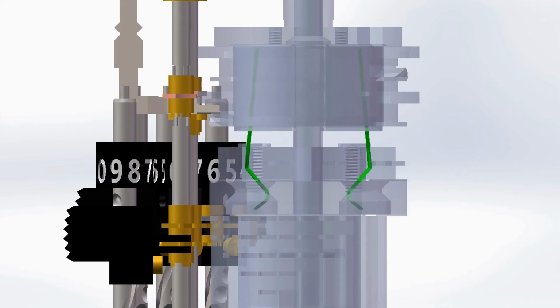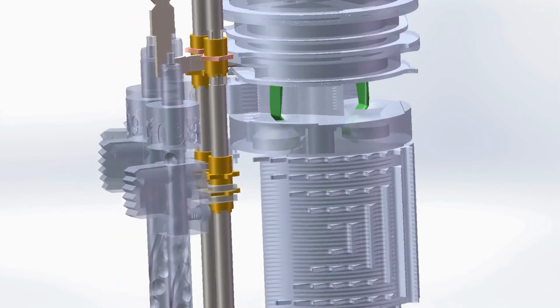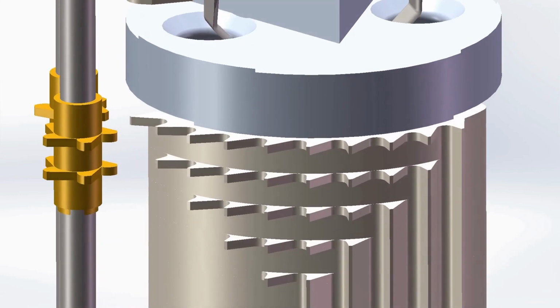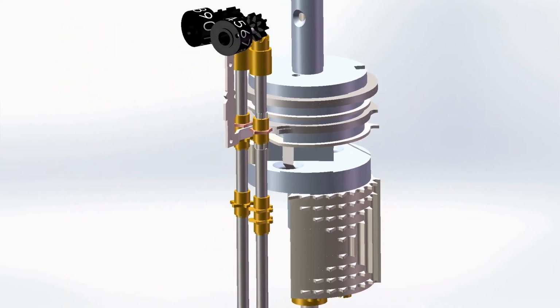While in this position, the step drum positioning spring can snap between the sides of a set of sloped holes on the step drum, holding the step drum in either the up or down position while allowing it to be moved with enough force placed on the crank handle. When in the up position, the subtraction step drum teeth mesh with the count gear assemblies. However, instead of having the corresponding number of teeth for the vertical position of each digit, the subtraction plates have the teeth corresponding to the 9's complement of each digit. The 0th position has 9, the first has 8, and so on. In this way, the 9's complement is added to the figure currently displayed by the result counter.